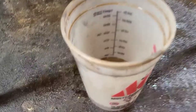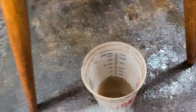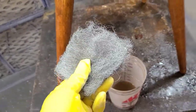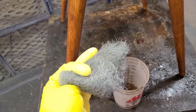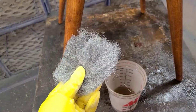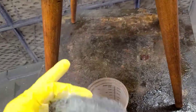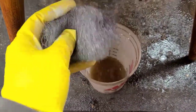I just poured a little QCS into this cup — it's a little dirty, so that's why it's discolored. Now I'm going to take this number one steel wool. Really, any coarseness is okay. I don't like to go super coarse because you avoid scratching the wood the finer you stay. Sometimes 4-0 will work, really fine, and other times the number one works really well. So I'm going to dip it into the QCS, get it nice and wet, and then just start to scrub.